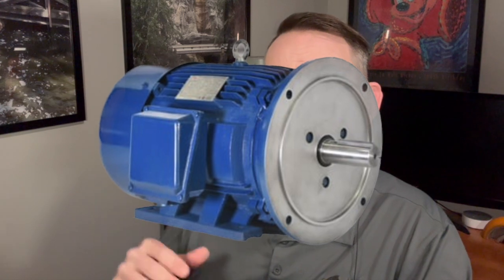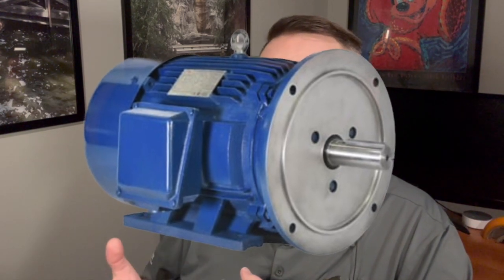So you use a really, really big AC motor, but then you can put a frequency drive on that and slow the motor down to slow the lift down and speed it up as you want to. But the older style AC motors, they weren't rated to do that really. So if you wanted to say, oh, here's the motor's full RPM package, and we don't want the train going that fast up the lift hill.